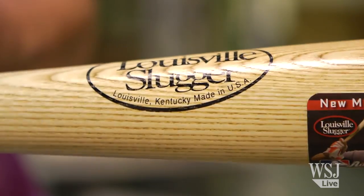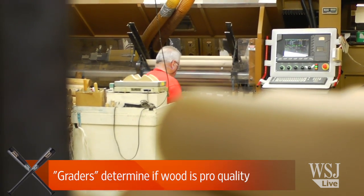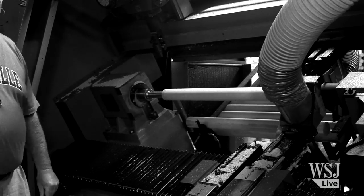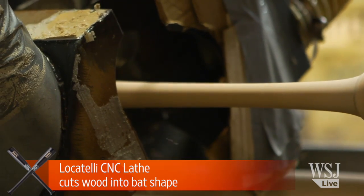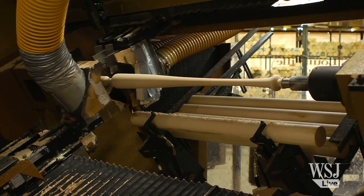So I'm going to put the magic goggles on and you're going to give us a little tour about how the bat is actually made. All of our pro bats in MLB Prime — all the wood for it starts right here. This is our sorting area. A bundle of wood comes in from the mills, then a grader comes in and grades each individual piece of wood, determining whether it is pro quality or not, weighs it off, and sorts it into the different slots. Then our turners come back here, select wood from each bin, and take it up to the lathe to turn it. This is our Locatelli CNC lathe — got it from Italy back in 2003. It's basically run as a giant computer; each program is brought in as files, and by the touch of a couple of buttons you can switch from model to model.